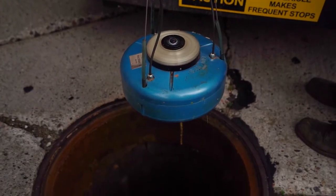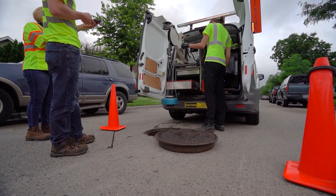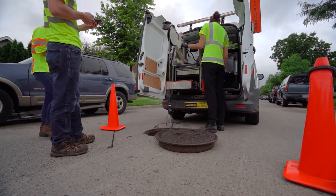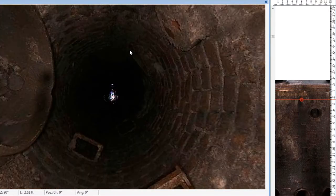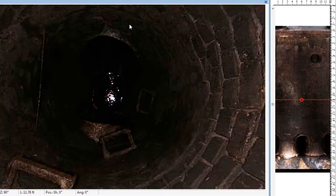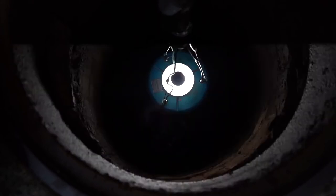As she's setting it up, she's about to run the camera down the structure. Going down, it is only just a positioning view of the structure — the camera doesn't actually start recording until it comes back up the manhole. The bottom lens is just flashing to give a little situational awareness, make sure they don't drop it into the bottom, check for any obstructions, and then they'll position it about six to eight inches above the bottom of the structure, and then it'll come back up and start recording that 360-degree image of the inside of the manhole structure.